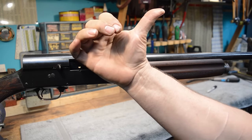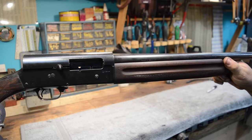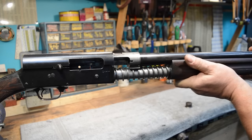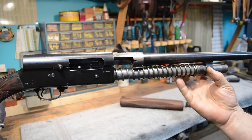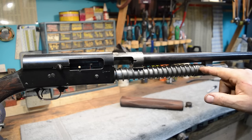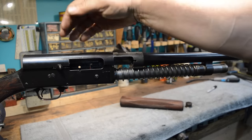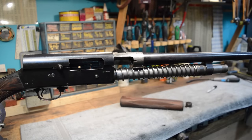We've got reaction and counter-reaction going on here. For most cartridges there is more counter-reaction attempting to push the barrel to the rear than we need. This is a brake — you have excess energy going to the rear and we want to dump that energy off, optimally storing only as much energy in this spring as we need. As it comes to the rear, we'd like it to be moving at about zero when it gets back here — the cartridge comes out, a fresh one pops up, and it goes back again.